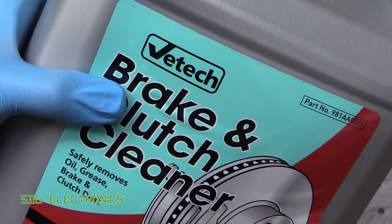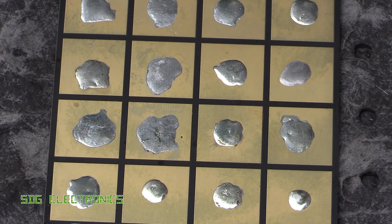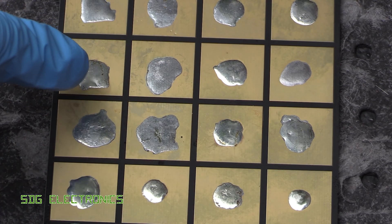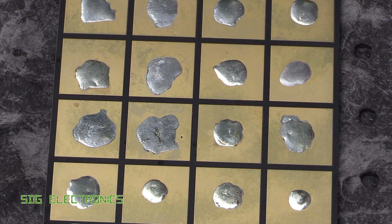So this time we're going to try VTEC brake and clutch cleaner. This brake cleaner left no problems whatsoever on this PCB — you can see all the markings are still there. The LEDs, the capacitors, resistors and everything are completely unaffected. But this brake cleaner is obviously quite a bit stronger because this is the PCB with the flux on it, and you saw all of the rosin here before that I couldn't lift. This brake cleaner just completely cleaned that up, no problem. Just applied a little bit to the surface, gave it a little agitation with the brush — very little agitation — and it just lifted the lot. Then a quick blast with a bit more brake cleaner and it's all completely clean. And the PCB has remained unaffected.